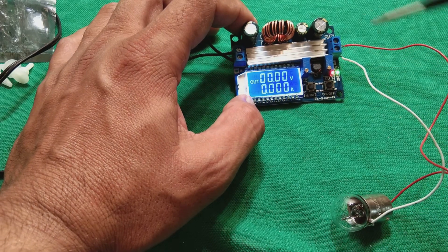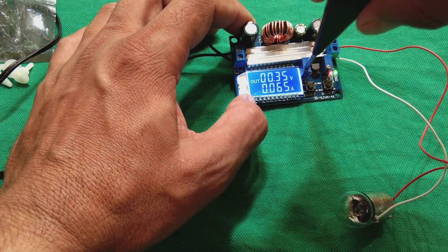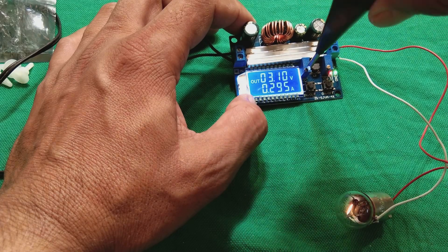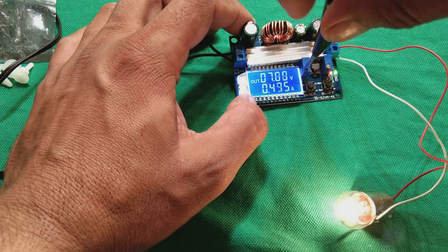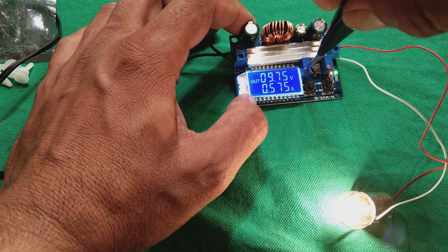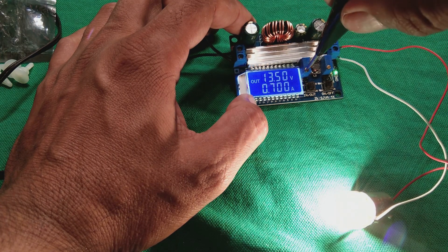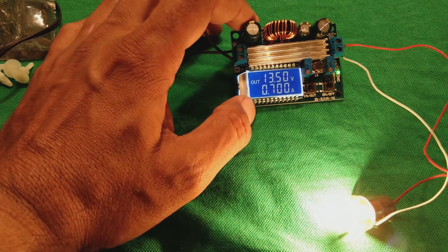This lamp below is not glowing anymore. We can increase the current limit by increasing the value of this potentiometer. It is multi-turn — someone commented on my channel asking why I am turning it too much, and the answer is this is a multi-turn potentiometer. Now you can see the current limit has been passed and the light is going perfectly.